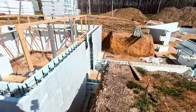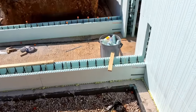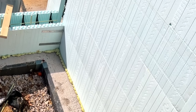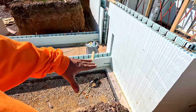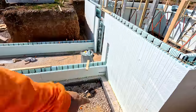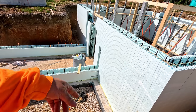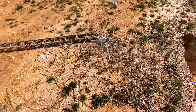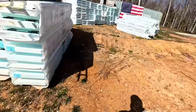Working my way out of here — this is the most confined, tough area so I want to start with it. There were some questions about the straps we did for the T-walls. This particular strap couldn't be completely flat against it, so people were asking if that affects your finishes. This one is on the outside so it all gets filled after the pour. If it was on an interior wall, it's not that much of a deal for sheetrock, but if it was causing interference you could cut it off and pull those straps — they're just there to hold everything tight during the pour.